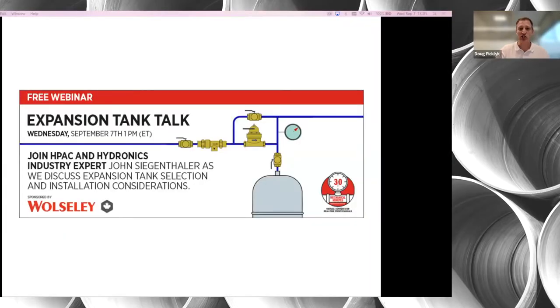Hi Doug, good to be with you. We're here today to talk about expansion tanks — an extremely necessary element in any hydronic system design. Expansion tanks help keep the pressure under control in your closed loop hydronic system. Sure, your system has a pressure release valve, but that valve is a last resort and you don't want it to come into play. The expansion tank should do the majority of the work handling expansion and contraction of the fluid.